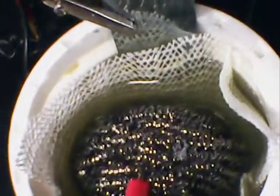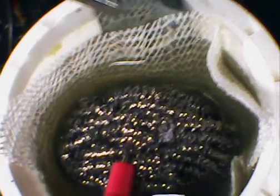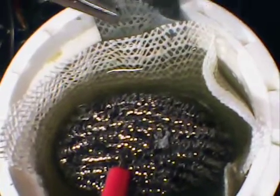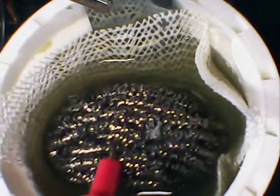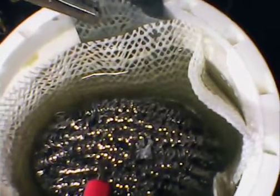What we have here is an aqueous magnesium sulfate heptahydrate — Epsom salt in water — electrolyte. I've got some matting in there; it looks like it's made out of polyurethane, and you can pick it up at the dollar store. I'm using that as my insulator, my separator.